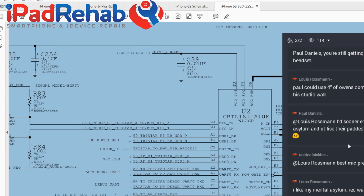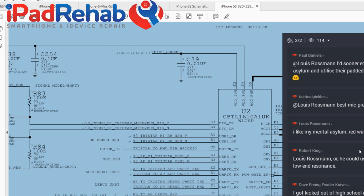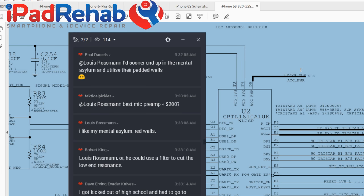All right. So now to finish this up, because we don't have a camera, I'm going to put a regular brand new TriStar back on here, because I just want to establish that this phone hasn't somehow become messed up, and that it actually can boot, charge, and be detected as normal. I'm just trying to think if there's anything else that I want to establish by measuring or checking out before moving on. So we've deleted this power into the chip really is what it seems like now. So this 3VO accessory might as well be called 3VO TriStar Power, because it doesn't do very much. Even though all of these are presumably intact, it really doesn't do anything else. So our theory that this was used to kind of power a fan or something like that. So the phone booted again and continues to not detect the cable in any orientation and pulls zero charging current.